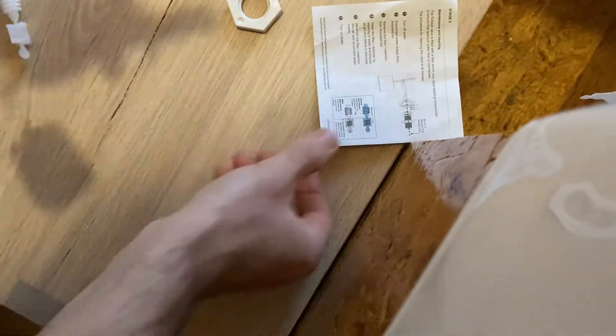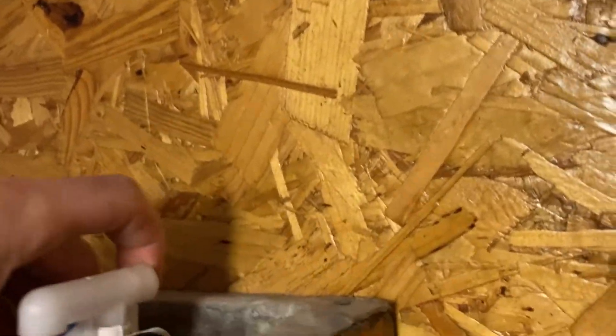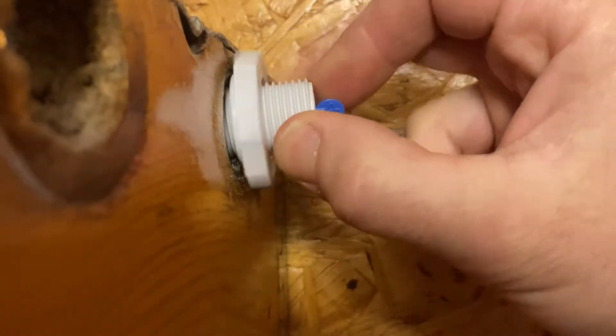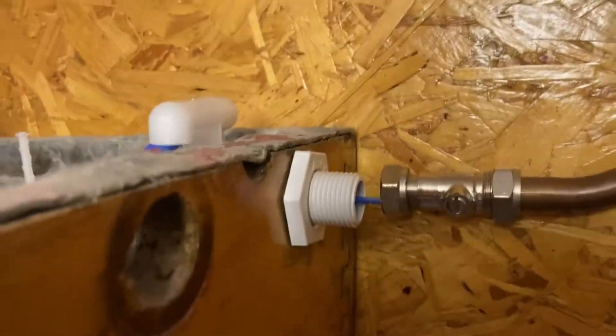It's quite a tight fit. I want it on this side. That's it on. Low pressure is blue, white is high pressure, so I'll put low pressure in. Just push this in like that and screw this back up and it should be ready to go. So we drop this in, wiggle this in — it has a rubber ring on it. But the reality is there's no overflow on this cistern, so if it goes, we're in a pickle. Now I need to twist this to get it. If it shoots down, that's an anti-siphon valve so I can't suck water back in.